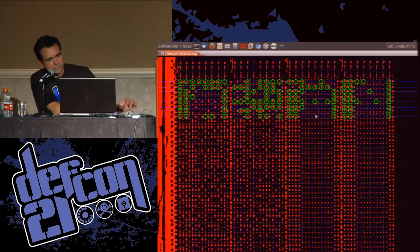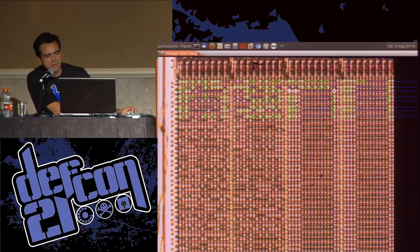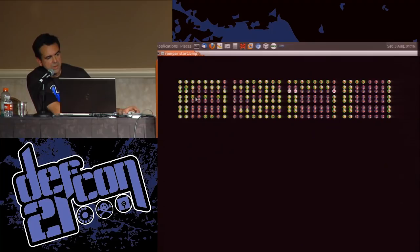And now you can actually see, okay, so those apertures, basically the automatic aperture size is based on the size of the gaps between the lines, so I can actually reduce those a bit if it's over-reading. We'll adjust this guy, adjust this. Oh, you can flip bits as well, obviously. And actually here you can see how useful peephole mode is, because when you're trying to manually check if you've got a 0 or a 1 in the right place and you've got all these other dots interleaved with these guys, sometimes it can be quite confusing. So if I go into peephole mode, all the extraneous imaging that my brain doesn't need to deal with has been removed, and I can just look at only the dots I'm interested in. Yeah, so that really helps.